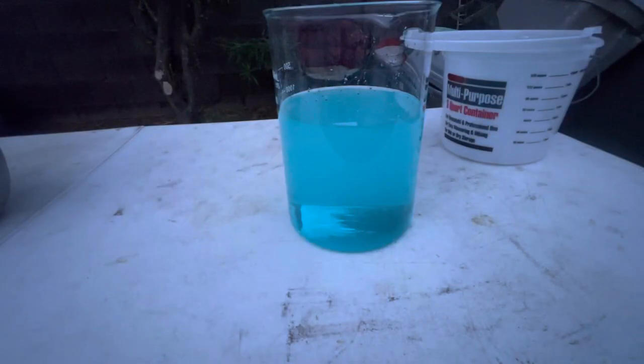All right, so now that you've seen me pour the electrolyte in here, this is what contains our silver nitrate and our silver. We're gonna add some hydrochloric acid, and that is gonna form a silver chloride. It'll be a white precipitate, and that'll be what we need to oxidize out at the next step. So that's what you guys will see next.